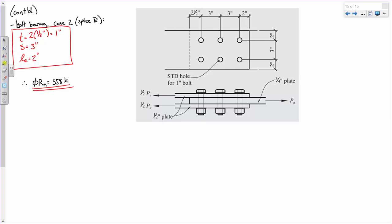Could you use 1/2 inch and just multiply by the number of plates at the end? You could do that. That's fine. Or you could just use a single thickness. It doesn't matter. What we're talking about at this point is just bookkeeping. So you can do it however you want. You could look at a single plate multiplied by the number of plates, or just use a composite thickness. You get the same answer.